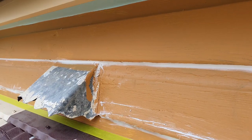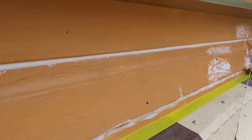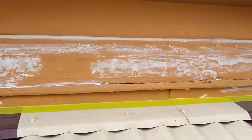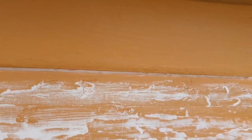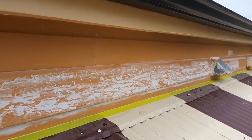Here are the boards — as you can see they are in pretty bad nick. They have already been sanded, scraped, and had a coat of primer. As you can see we're just going through now getting all the nail holes, all the highs and lows, all filled up as we go along. I've done this section along here. We're just filling it all in like that, making sure we get it as smooth as possible and we fill in all them lows.